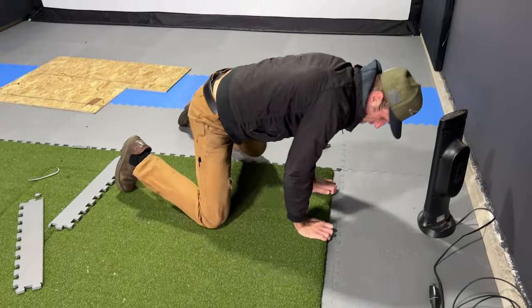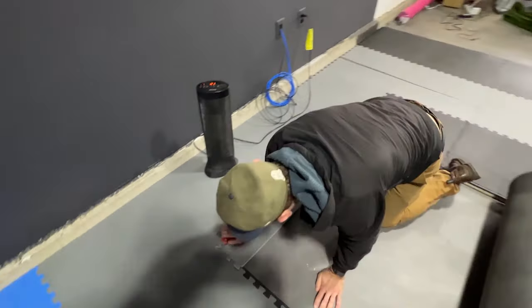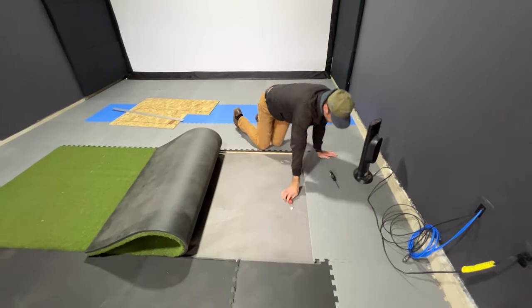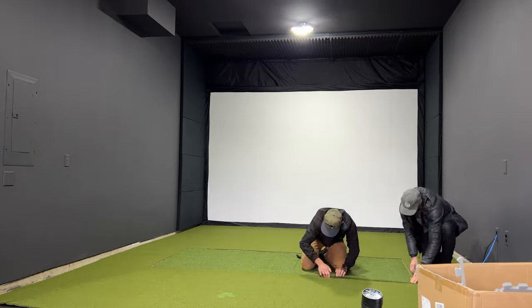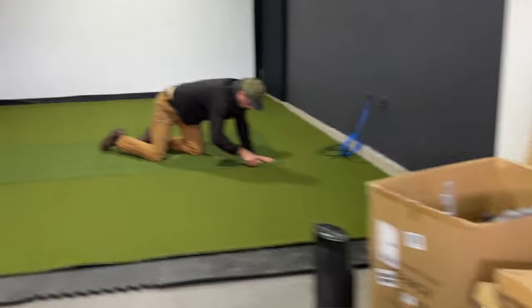I played around with it to get the height where I wanted it. I sheeted the entire floor with OSB and cut it to length at the 20-foot mark. I laid the mat down in the middle, centered it left to right, positioned it where About Golf's team told me the center of my hitting strip needed to be, outlined it, and took the mat off. I pulled the OSB back up, cut those lines out, replaced it for a perfect fit, then put the rubber floor on top and cut the edges clean. I removed the hitting mat, laid the turf down, cut it on the outside so it laid flat, then used a knife along the wood to cut a perfect rectangle — and the hitting mat sits perfectly flush.